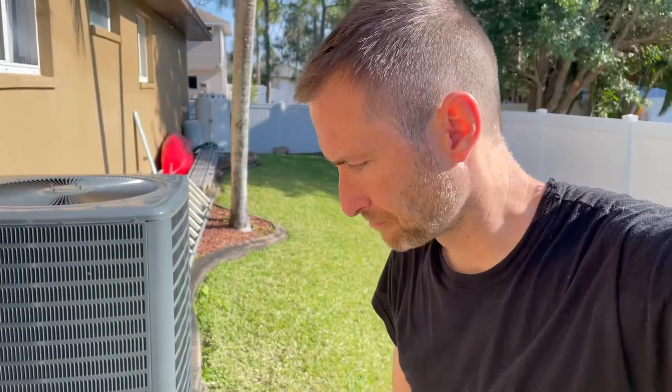Basically, your breaker is a safety — it prevents fires, but there are occasional fires that do happen. Sometimes breakers can fail, but that's what it's there for. Those wires were loose inside the split bolts in the disconnect. That disconnect is up next to the air handler — it's just a connection point for the safety of the technician, so they don't have to go search for breakers and they know the power is off.